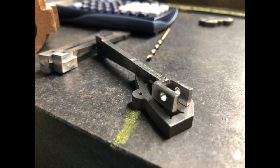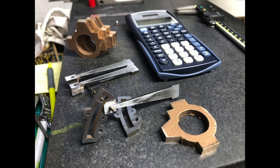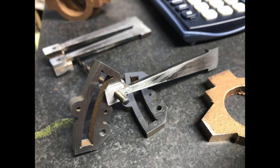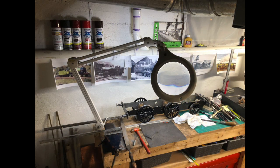This was relatively straightforward and my little Maximat lathe milling attachment didn't have too much trouble with that. I then turned back to the rods and to establish the amount of material needed for the forked ends, I used some quarter-inch square bar and silver soldered that onto the ends in a relatively straightforward operation, before returning to the mill to machine the fork where they could then slot into the rest of the valve gear.